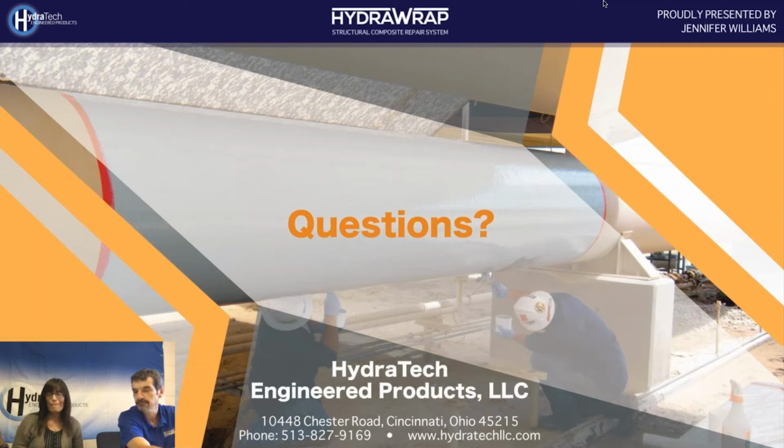Okay, so it wasn't testing on the actual installation at the plant or for your client. It was a simulated testing 3, 5 and 10 years out, correct? Correct. Sponsored by the Pipeline Research Council. Okay. And then my second question is, you mentioned that for these kits, it's only with use of common hand tools. So how would you control for weight to resin ratio of the wet layup carbon fiber to ensure adequate saturation of the material?